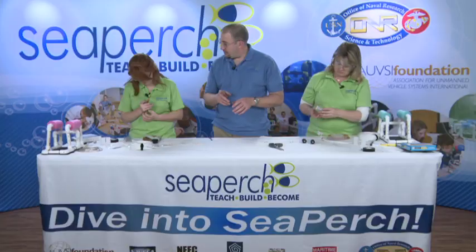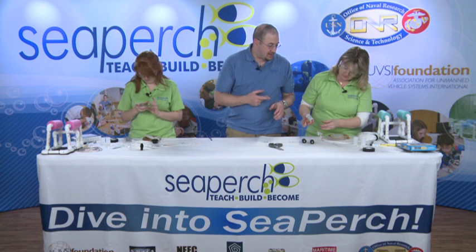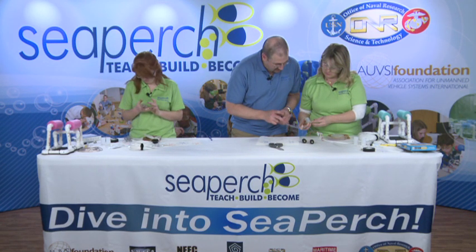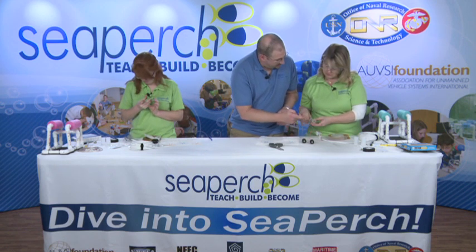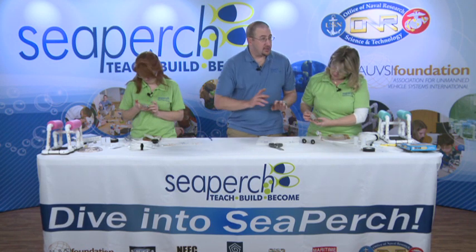Get it in place, and all you need to see is that bottom quarter inch where all the wax contacts. Just press a little more — don't be gentle. Now you see that seal all the way around the bottom. A little bubble there on the side — those are all fine.